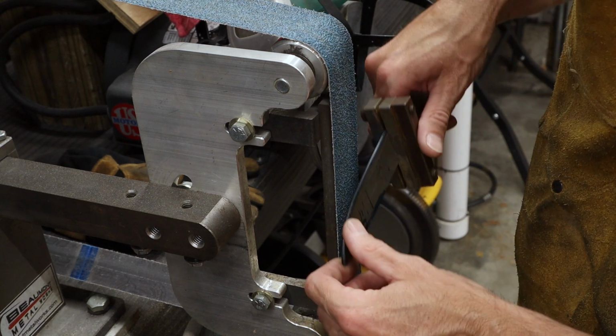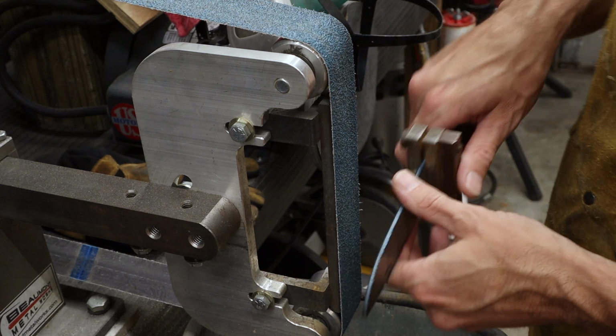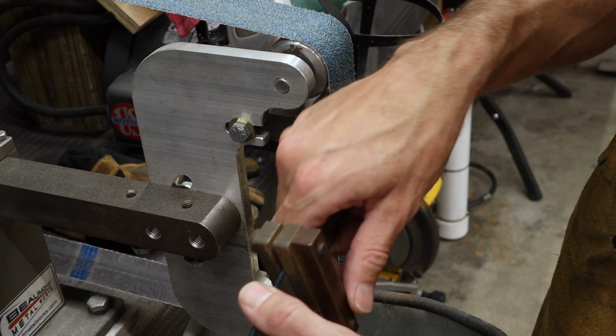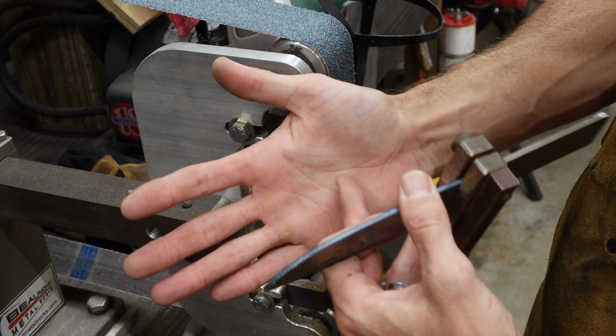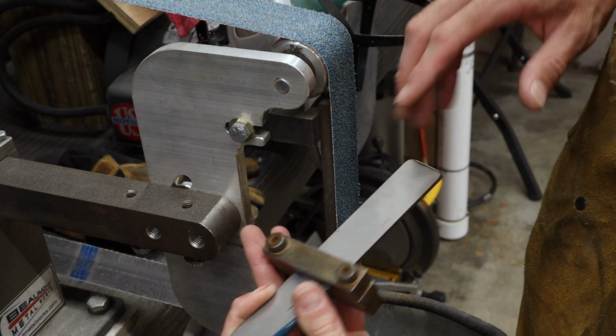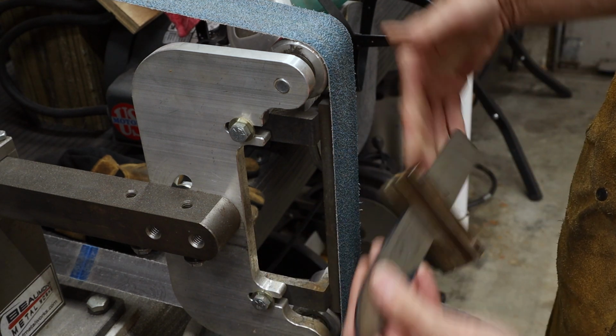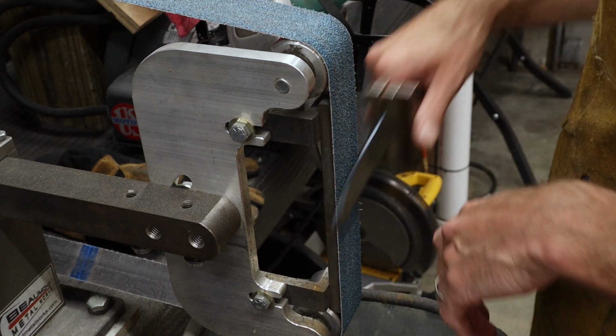So that means when I come up to my grinder, I'm going to be laying in just a little bit at an angle like this. This is why I ground these tips off, because if those tips were still there and I was trying to get any leverage, that tip would be digging into my hand right there. That's also a reason I didn't grind the tang yet, because I wouldn't have enough to hold on to back here. So I leave that whole piece of metal there. That's going to help me with my grinds, and I can pull these through.